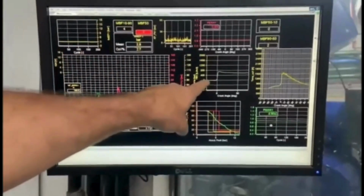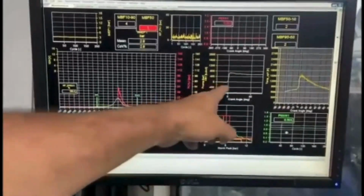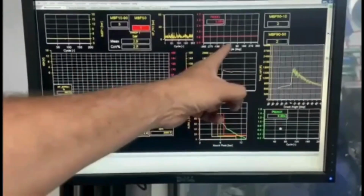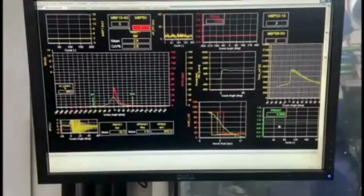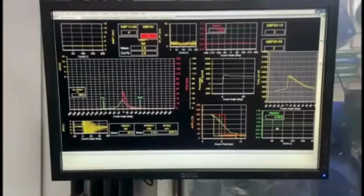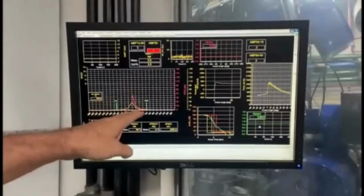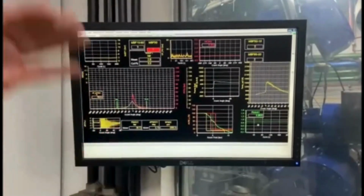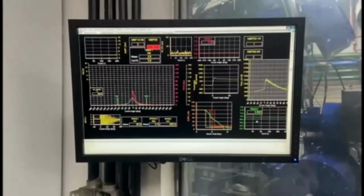And here you can see the heat release, okay? And the rate of heat release here. And you can see the sharp curve here, the sharp slope, very fast. We can burn everything. So we start the combustion in several parts of the combustion chamber simultaneously to burn all the fuel at a glance, right? And this way it's very effective because you do not lose heat to the atmosphere as you lose in a normal combustion system like a spark ignition system.